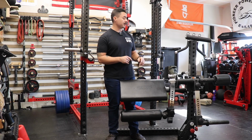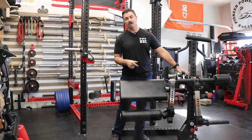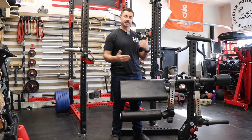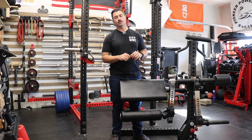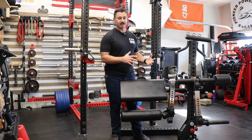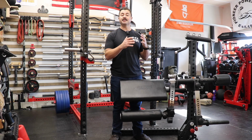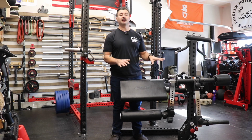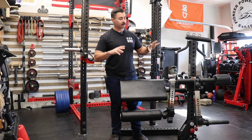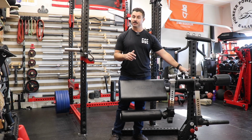Part of the reason that it's a pain to actually adjust up and down is because instead of a normal carriage assembly for like a trolley arm, which uses rollers, this just has the UHMW shims and then the one guide roller that keeps it in place. Because of that, there's a lot of friction inside of the carriage assembly, and even when you loosen those thumb screws all the way, it's just one of those things where it's a pain in the butt, so you're going to tend to not pick the movements that require you to move it around. That is one area where I could see a little bit of improvement in the product design, but really we're splitting hairs at that point because this thing performing with the UHMW is great. You're able to take up that tension, and I don't know how you would be able to remove that slop if you were to introduce side rollers into this assembly.